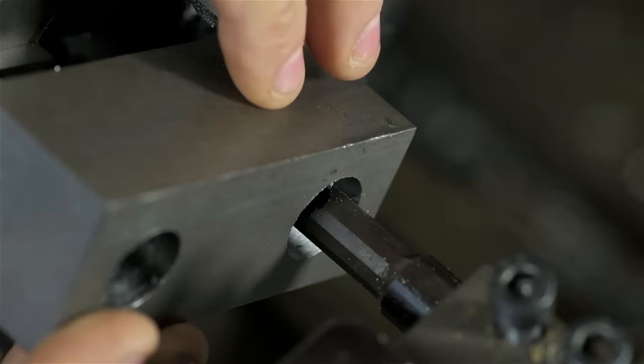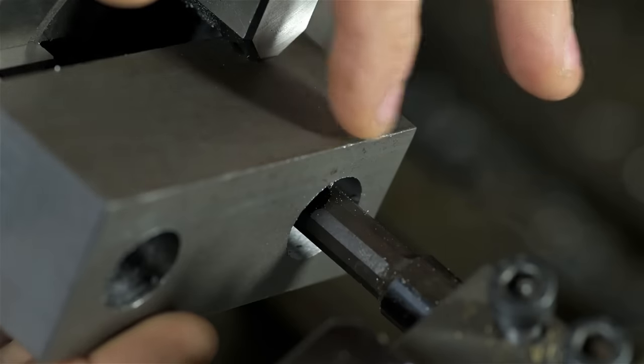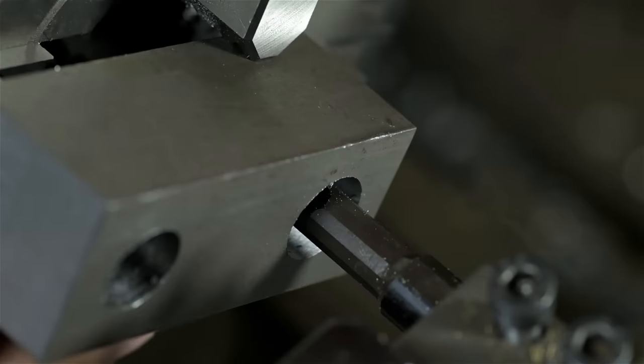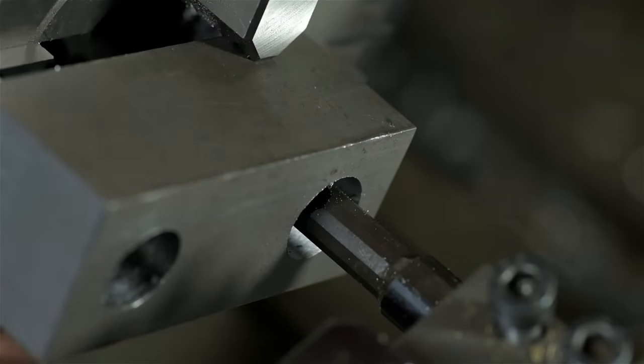If you can hear that, and it sounds a little crunchy to you, it's because it is. The cut technically wants to go faster. At this small of a diameter with a carbide insert, I'd really want to run the lathe at like three times this speed. But because the part is so out of balance, I can't really run it that fast. This particular sequence would run the risk of becoming a Benny Hill scene where the lathe is chasing me around my shop.